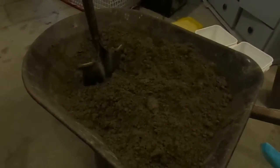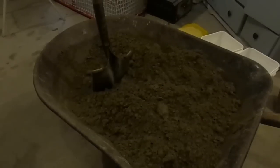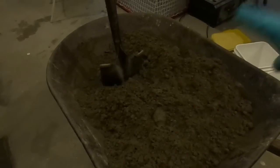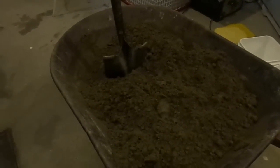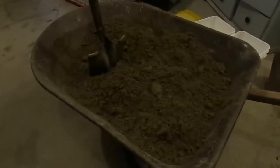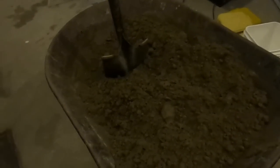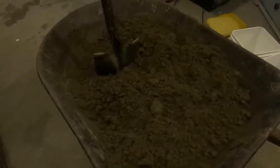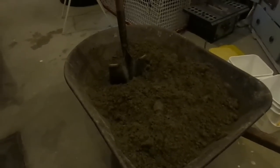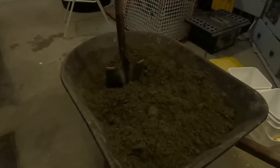The fortifier was 0.95 liters, one quart each, so I added 2 bottles per bag instead of the 1.7 liters which they said to add. So I added a bit more, and I balanced it out with the water. The smell is really strong, so you have to wear a mask, gloves, eyewear, and even hair wear, which I'm wearing right now. Because last time I mixed up concrete, 2 spots burned my arm, so I'm not taking any chances.